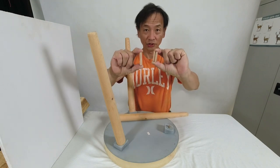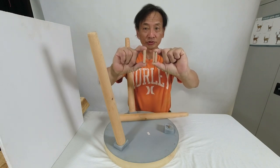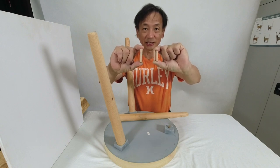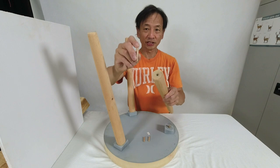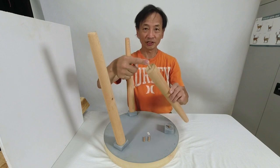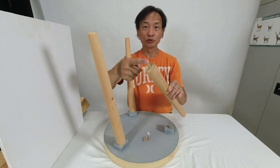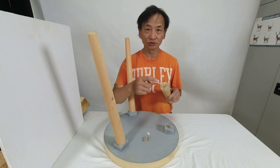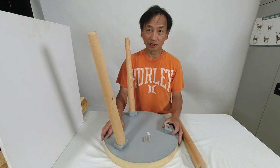Join me in this video as I use timber dowels. This is an 8 millimeter diameter dowel, and these two are 6 millimeter diameter dowels. I will lightly use the 8 millimeter dowel to fit into the hole, apply wood glue, and then drill the hole to fix this timber screw into the timber dowel to repair this coffee side table.